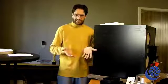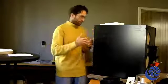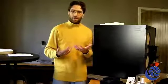So can I tell you, yes, you can stuff it into a closet with very little clearance around it. Would I recommend that? Absolutely not. If that is going to be done, I would tell you to make sure that the unit can be pulled out easily. In other words, you have enough access, you have a door big enough, and you have some nice connections here that are easily removed so that you can just slide the unit down out of there for any other maintenance requirements.